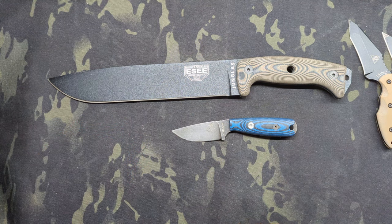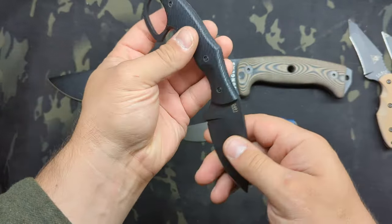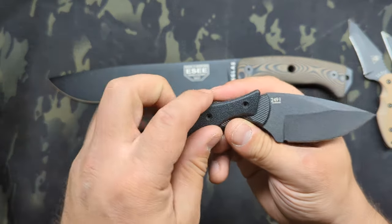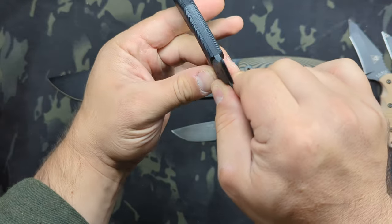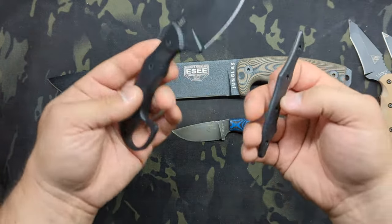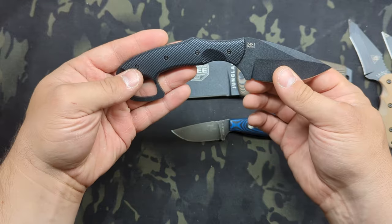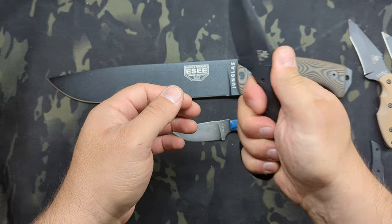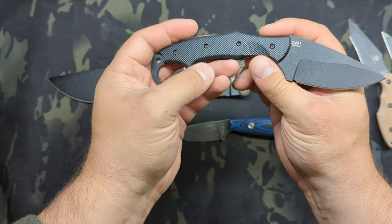The next thing is Kydex. I actually make things like Kydex knuckles by fusing layers of Kydex with heat and pressure and then machining them, and these scales for the TDI Pocket Strike are no exception. I kind of redesigned the scales — the factory scales really don't go to the edge of the tang and they're very flat. My scales are something like a sixteenth thicker at their thickest point and it really makes the knife fill out the handle a lot better. These are my design but I used quintessential elements of the TDI handle series to model them. Those Kydex scales feel really, really nice and they look a lot prettier than I expected Kydex to when you run the machine over it. Let me know what you think in the comments.